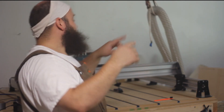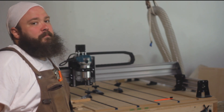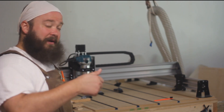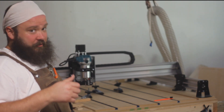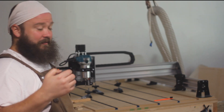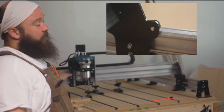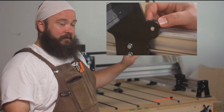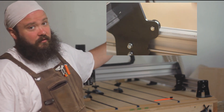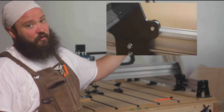Next, the wheels on the side — they have to be properly tensioned. If you cannot roll them with some effort, they're too tight. If you can roll them just by basically pushing your finger across it, they're too loose. You got to take the little odd nuts that are on here — just like this video, watch up here. It'll show you that I'm trying to move it with my thumb — can't move it.